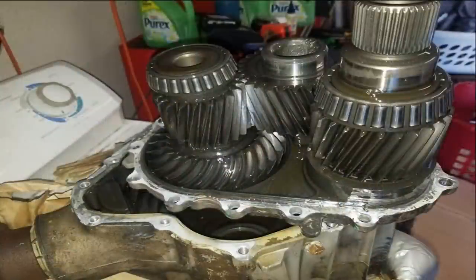So therefore, since there is no way to do the PTO, as they say, without removing it and changing the seals, then you're going to have to remove it. And at that point, decide if it's a new one you're going to buy or rebuild the old one. But as far as the fluid, it should be changed any time the PTO has been submerged in water. Okay, we know the PTO, we call it the PTU. So if your PTU has been submerged in water, you've got to change the fluid.